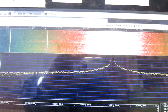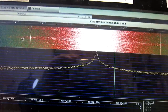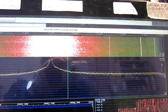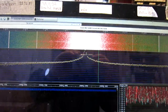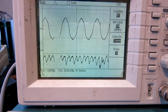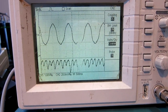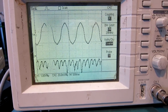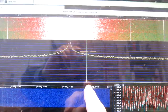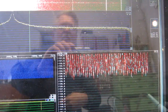I run the waterfall faster, and it's quite clear in the close range — this noise variation comes with double frequency. It means I have it from both the I channel and the Q channel at the same time, and they are phase shifted by 90 degrees. This is when I look much closer — this is 7 kilohertz or something from the center, and there the noise is much stronger.